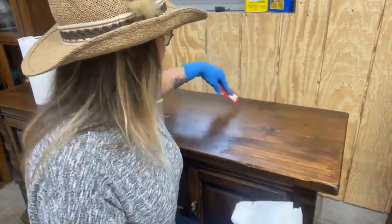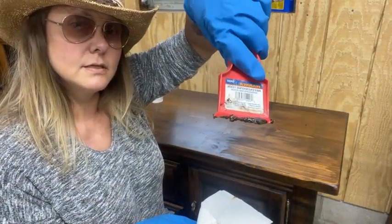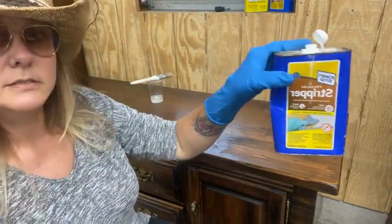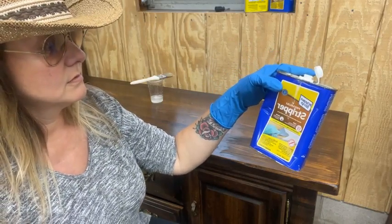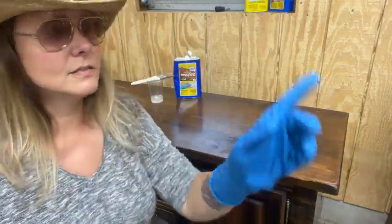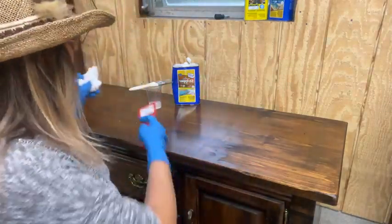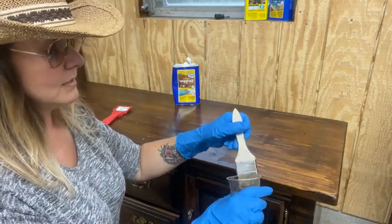The top on here is a real soft pine, so we don't want to dig in too deep. I just want to take off just the very top — it's a Clean Strip. Get it at Lowe's or Home Depot. It says it works in 15 minutes, but you kind of got to play with it — it depends on your weather. Definitely want to wear gloves, and have some ventilation. I've got my window here and I've actually got the garage door cracked also. It's really strong, so if the smell bothers you, you might not like this.